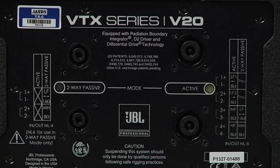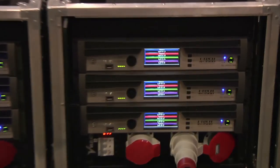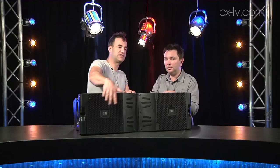If you've ever been skeptical about JBL, you need to get in front of this and hear it. We were listening to it in a pretty solid configuration — you can run this in two-way passive mode, but we were listening to it in full active, with the whole system being driven off Crown V-Racks, which is what it was designed for. You can get a triple two-channel amp V-Rack or a triple four-channel amp V-Rack. Off one of those four-channel amps, you can hang up to three V20s, giving you nine elements per V-Rack. In full active mode, you've got one amp channel for the low 10, one for the other 10, one for the mid, and one amp channel for the D2 high-frequency driver.